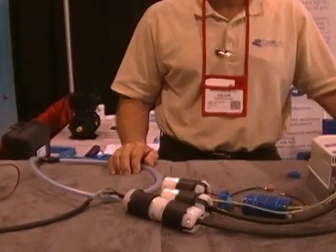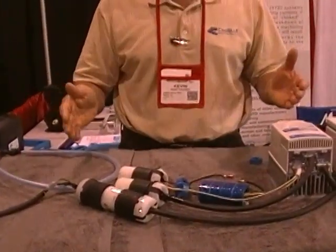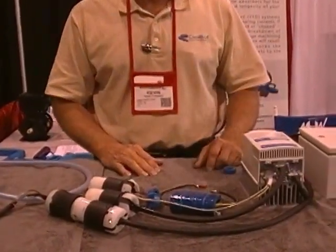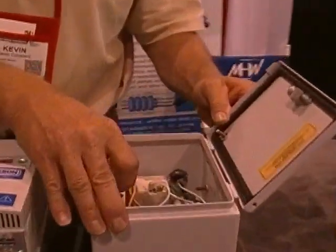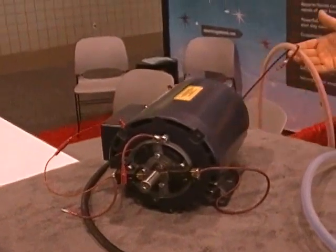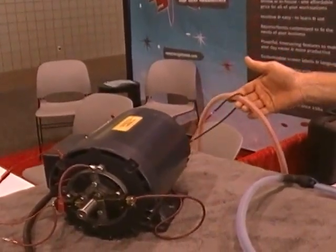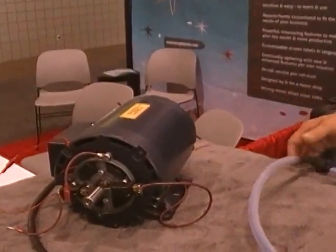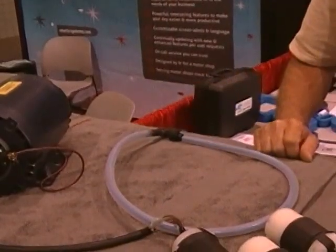Now, we are going to start up our motor on a static drive to represent what standard three-phase looks like without the use of a frequency drive. What we have is a static phase converter. The motor has now been started. We actually have a Rogowski coil that is tied to the wire on the back of the motor through the bearing. This Rogowski coil measures the common mode current on the T-leads.